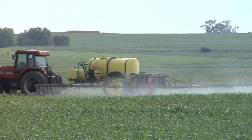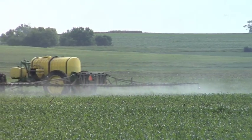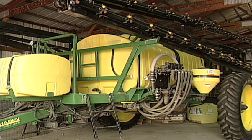If you want to keep a poly tank, here's what we do on our farm: we do the whole triple rinse — rinse it, use tank cleaner, rinse it again. But we take one more step. If we're going to switch between really harmful products and a very sensitive crop, we let that spray tank sit with water and tank cleaner overnight. If we don't do that, we do not switch to that crop.